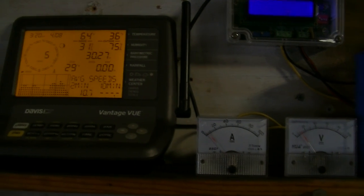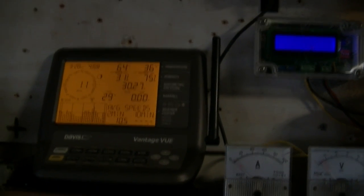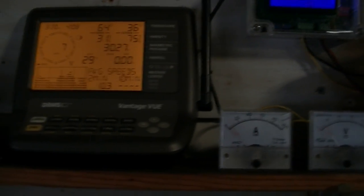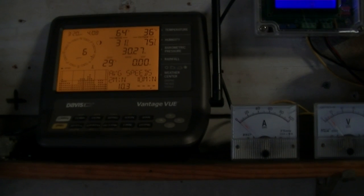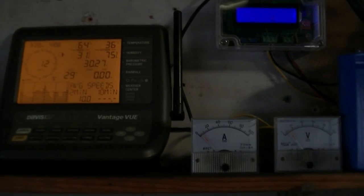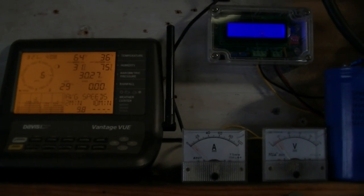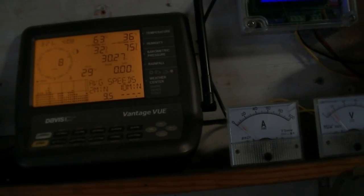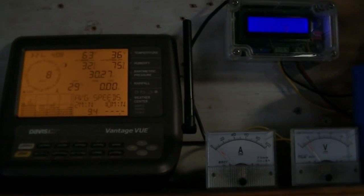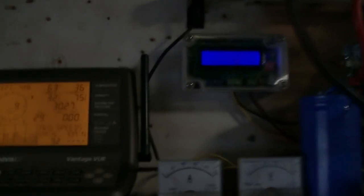The wind's just changed direction again and they've been gusty. They've been pretty steady earlier but it's low right now. This is the opportunity I have - I want to get up on the roof and get the five wind grabbers off and slip this up there. I've got five KT cleared blades on the 10-blade hub, but I'm only using five, so I'm using every other hole. I'm not changing the number of blades I currently have on the wind turbine, I'm just changing the type of blade.